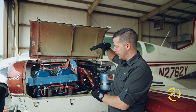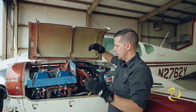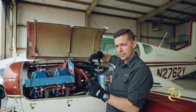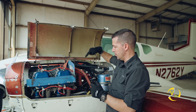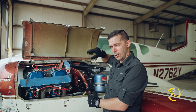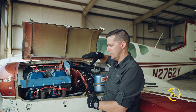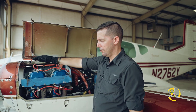Here at the back of the case we have all of our accessories. In the accessory gear case at the back, we have those gears connected to the crankshaft, and that series of gears is turning things like our magnetos, our vacuum pump, our oil pump, and our fuel pump. In some engines we also have our generator or alternator back here. In the Lycoming-style engine we're looking at today, the alternator is actually belt driven on the front of the engine.